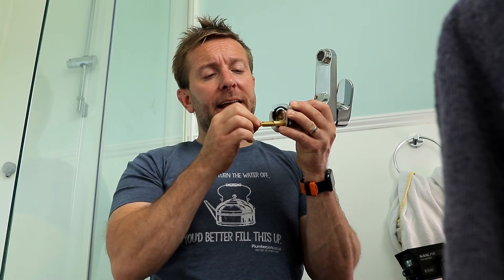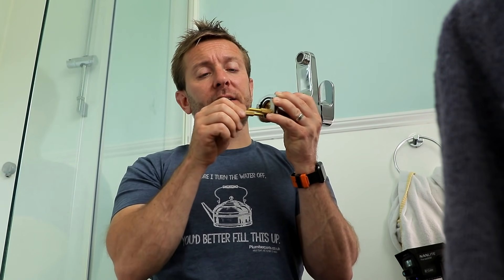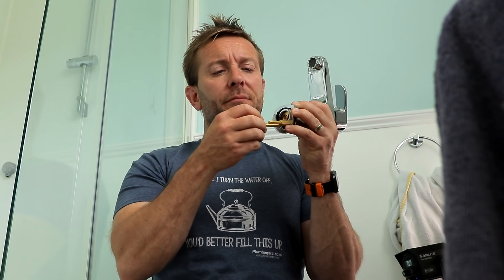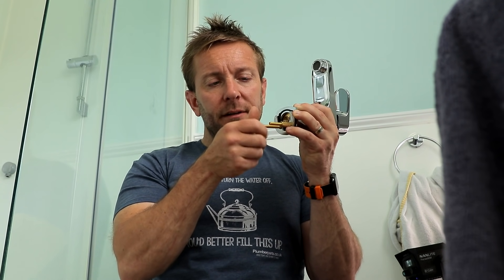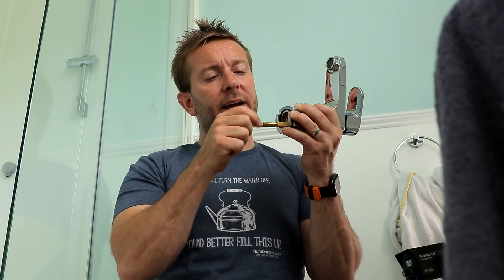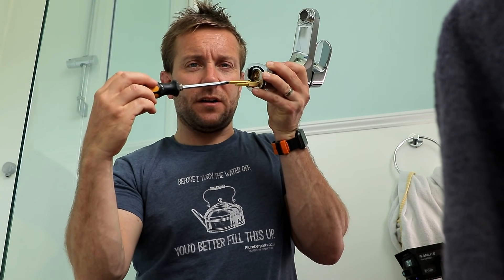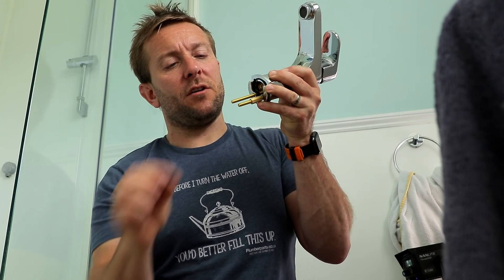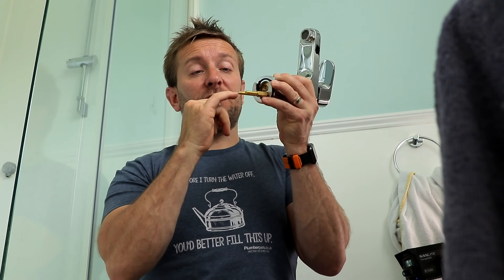Right then, so now we prep a new tap for install. Best way to do that is to strip off the nuts on the bottom here, just take these off nice and quickly and pop them to one side - obviously we're gonna need these in a minute. Then we'll just get a screwdriver on the end - you usually find there's a little slot at the end of these studs, and just give that a little nip. Don't go too much on these, otherwise they'll splay the thread at the end and you won't get your new nuts on once you've taken them off. And then you will go nuts, believe me.